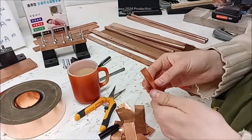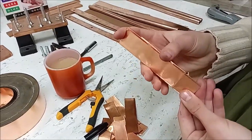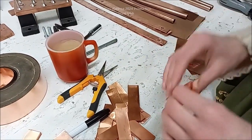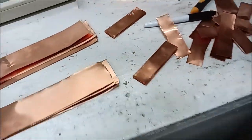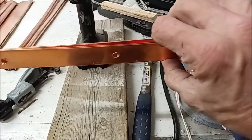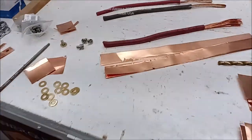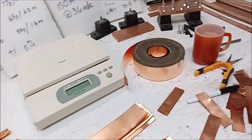What we're doing is technically making a thickened bus bar. If you're one of those guys saying you can't do that and have to buy a Blue Sea product, I don't want to hear it. It's copper - it's just copper. Where your compression point is for your bolts, that's going to compress all of it together. As long as each layer has the same compression points, you end up with the same thing as a thick solid bus bar.